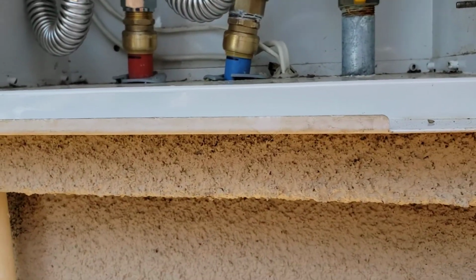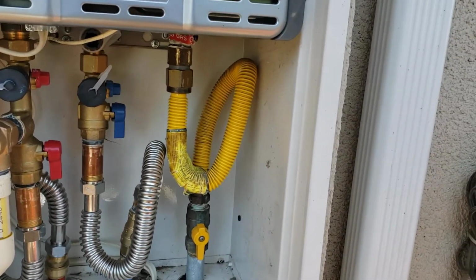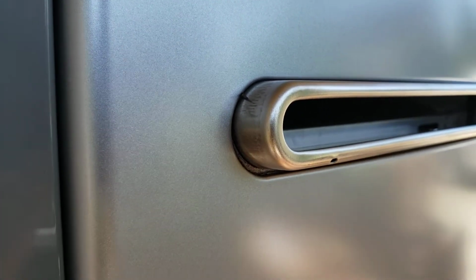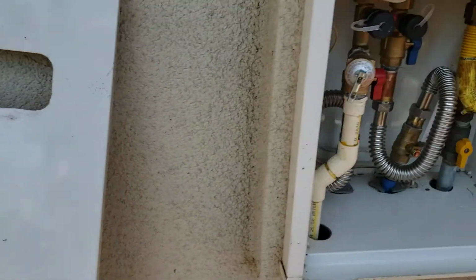The water heater is on, it's wired back in. You may have to adjust your temperature on your controller, which is probably in your laundry room or somewhere like that. Adjust it back up to 120. But we've fired this and the unit works great. We did have to modify your cover. It's a little short on this side, so it was hitting that edge of the exhaust from the water heater, and then it was a little too tall. It was up about here, so we had to cut out the bottom, cut some nice corners, and then we filed it and sanded it. You can see I'm running my finger along it right now, so it's pretty smooth, but just be careful with that. Anytime you got sharp metal corners, you need to be careful. And so that looks good. We'll get a piece of sandpaper and sand a little bit more. Anyways, everything here looks good. Outside of that, this installation is done.